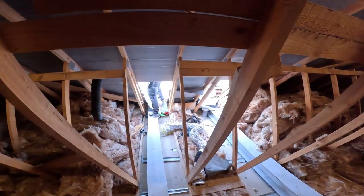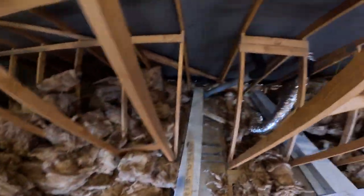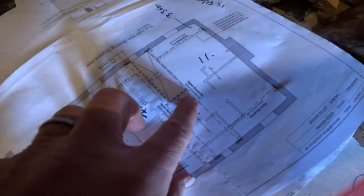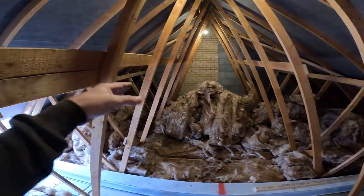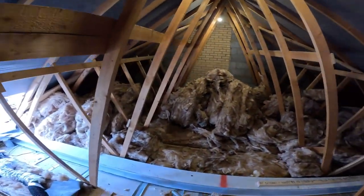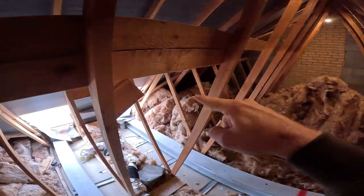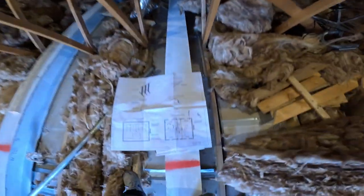Whilst they mess around outside taking the rest of the delivery, I thought I'd jump in and talk you through what we're doing inside on this one. So we've got these two spine beams - 203x60, which is basically the weight of the steel. They run front to back on small bearing plates, and that's split the span of the steel down. Because we've got the stairs in the middle here, we need two of these for one each side to pick up the steel. So we're going to have an eaves beam going along there, an eaves beam going along there, same thing again on both sides.